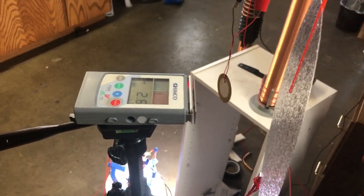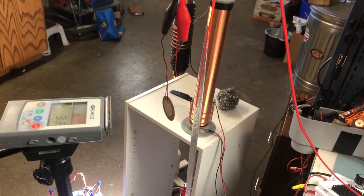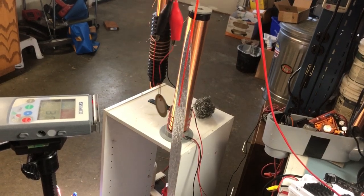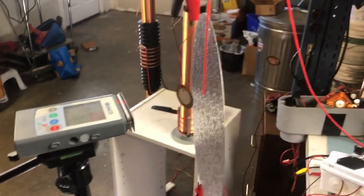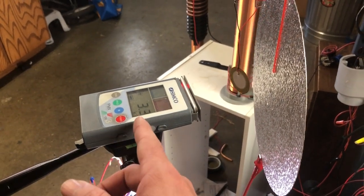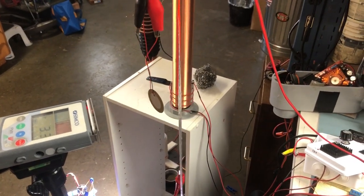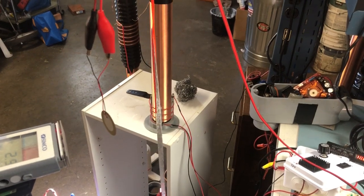I've got to wait until it's steady again. Sounds like the buzzer's giving up the ghost. I'm not changing anything at the moment — letting it steady. When I pushed the button, it did that. I think when I push the button, it releases the static charge that has built up on the piezo, because I've observed it: when I push the button, I'll see this go positive about a couple hundred volts. And then when I had the negative attached to this big disk, it would lose a little bit of its negative — it would go down a couple hundred volts. So it would be like negative 2 kV and then go down to like negative 1.6 or negative 1.7 kV when I push the button.